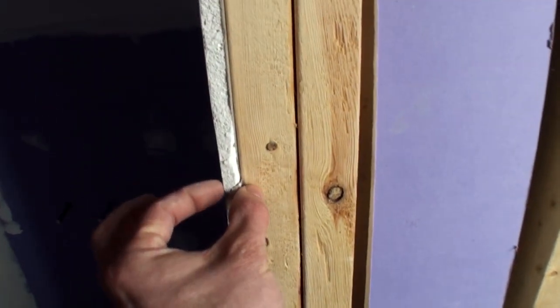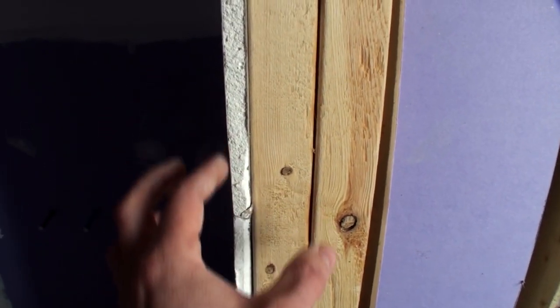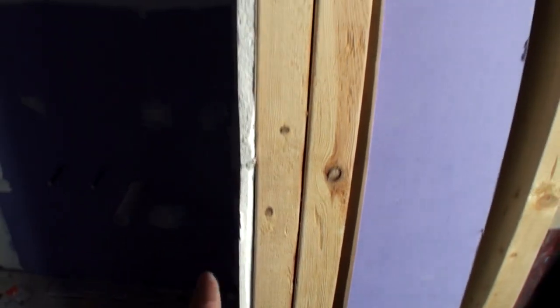In the bathroom, I used the purple board — the moisture-resistant drywall. I put it on the walls as well as the ceilings. It costs a little more than normal drywall. I've got corner beads on the outside corners, and the area where tile will go doesn't get drywall. This is also a good spot to show the bevel joint. You can see the thickness difference — probably a sixteenth to an eighth of an inch — which creates a small valley that you fill with joint compound.